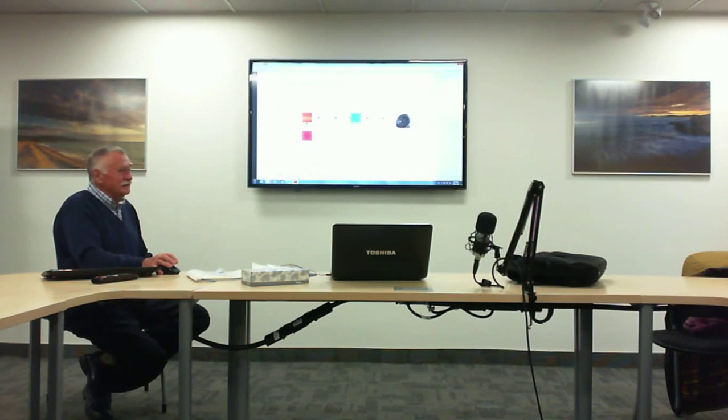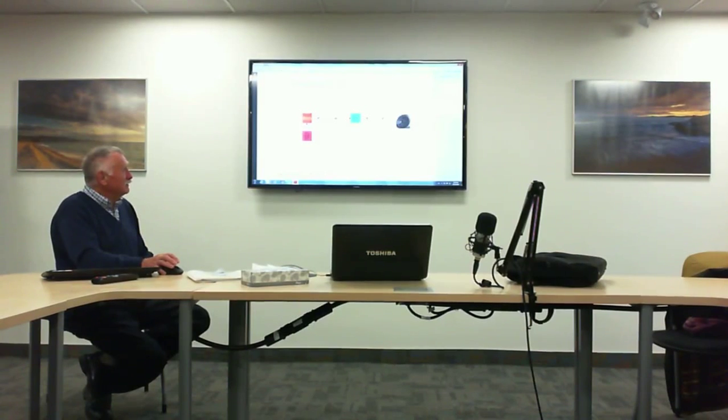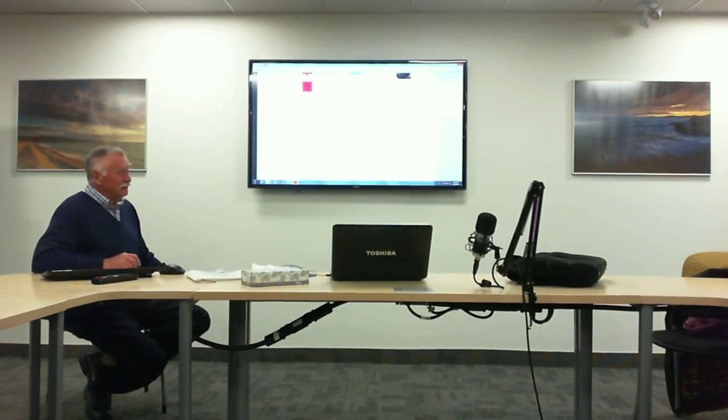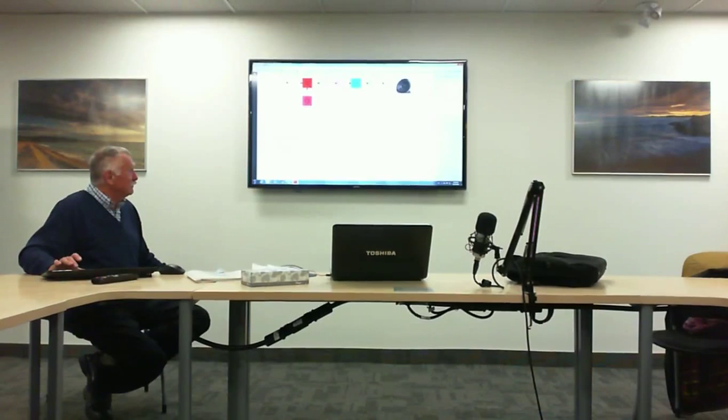Now, you substitute X and Y with the local oscillator frequency and the RF frequency from the antenna. Therefore, this equation gives you the difference between the local oscillator and the RF signal and the sum of the two. Now, either the difference or the sum carries the same amount of intelligence. So the intermediate frequency amplifier is set for the one or for the other, choice of the designer. So that was the block diagram of the superheterodyne radio, pretty well as Major Armstrong conceived it.